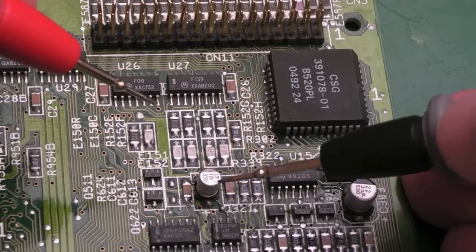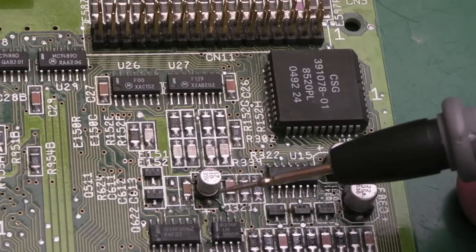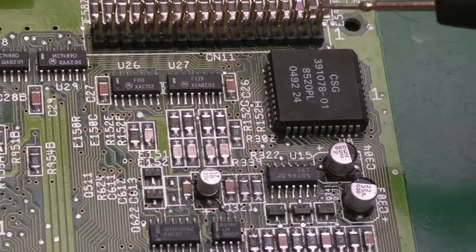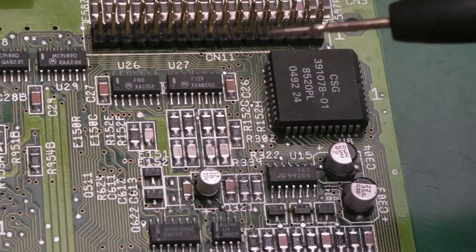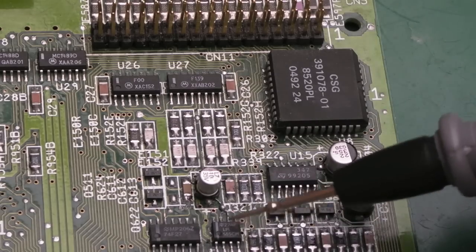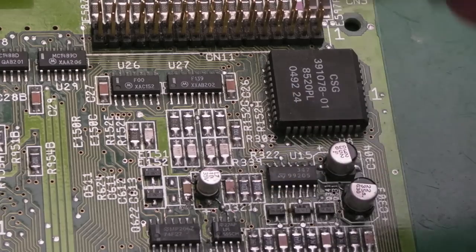The first thing that's got me concerned here is around the 555, because as I said, with the red screen thing, and then you power it off and on, it'll be alright consistently. So you'd switch it off, come back the following day, switch it on, red screen, switch it off and on, be okay. That pointed me towards the reset, the 555 here. And this is where we've got two or three wires and things around here, and, well, there's an issue.